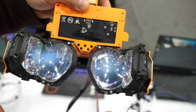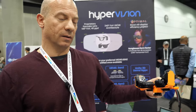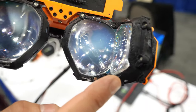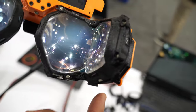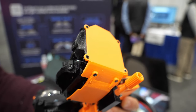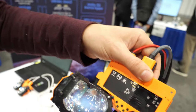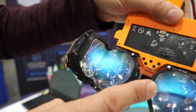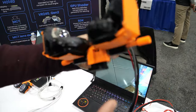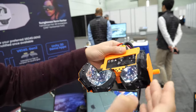We are covering completely the horizontal field of view of human vision. It's not a secret — it's already published. You can see the connection between the two pancake lens modules on this line. From the other side, you have a display here, a display here, and a display here — they are not connected. But the recipe is to generate the same image at the overlap region on both sides. So after manipulation by the lenses, the rays going out of this line are connected. The rays coming from a pixel here and a pixel here are matched, so the eye cannot distinguish between them. We see a seamless connection between the two modules.